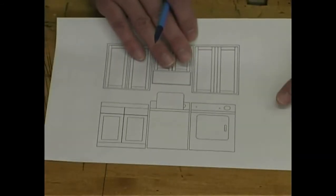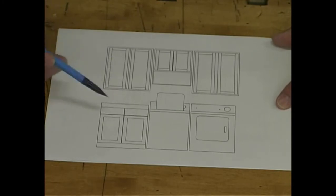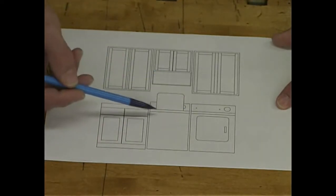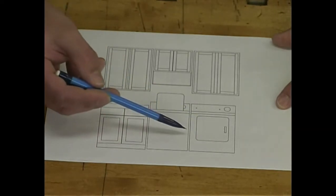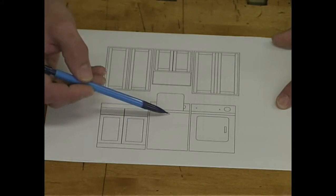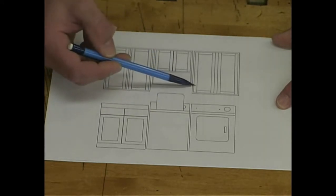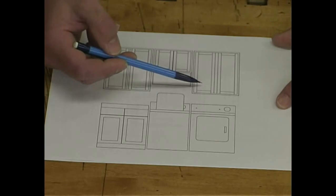Now, going back to this drawing again, one of the concepts that's different with the laundry room upper cabinet structure: the laundry equipment, the wash tub, the washing machine and dryer, they stand out further from the wall than a typical kitchen counter. Often you have the dryer vent hose and so forth, and other things back there, perhaps gas or power. And that brings this equipment forward about 6 inches further than the front edge of a lower cabinet, say in a kitchen. So to help make accessibility easier on these upper cabinets, they're about 5 inches deeper front to back. That'll give more storage in them, plus make it easier for accessibility. And that wraps up the details and overall concept.